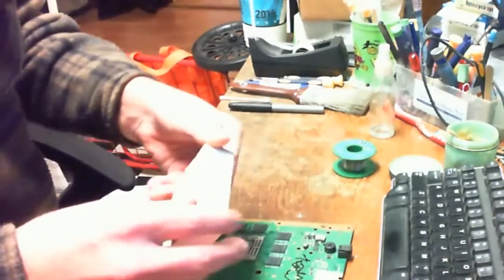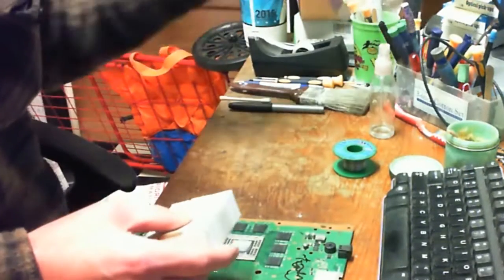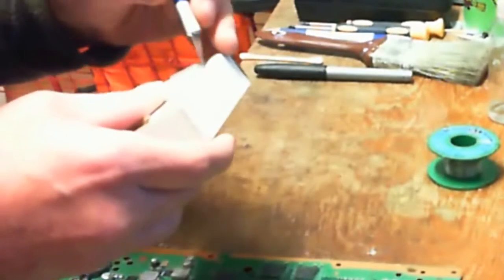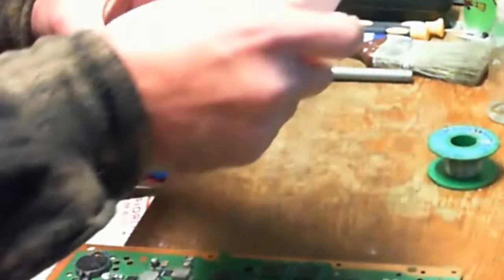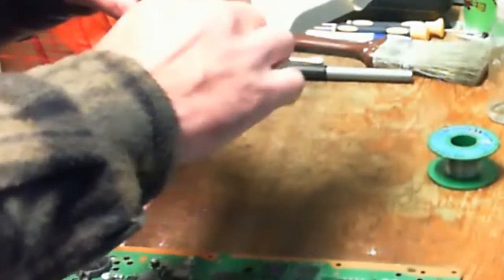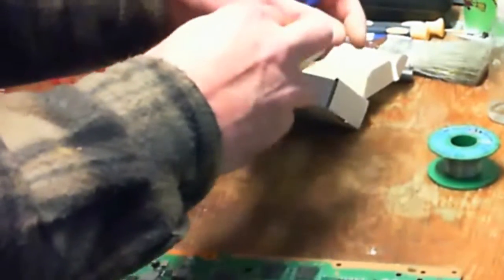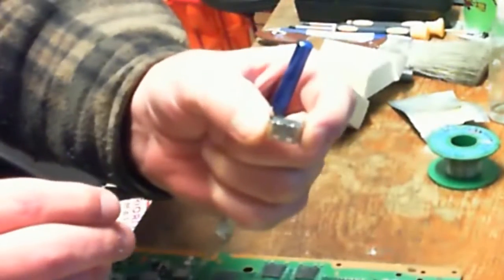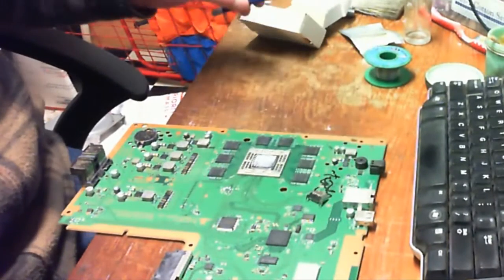Alright, and so what we need now is a replacement HDMI port. Now, I do use upgraded ports where the entire backside is locked in and all of the contacts themselves are behind a plastic barrier, and then on the face side, rather than the pins just sitting on top and bottom, they actually lock into the inside of another plastic retainer, which prevents the HDMI port from actually grabbing them and ripping them off. So yeah, much better.